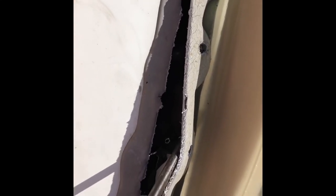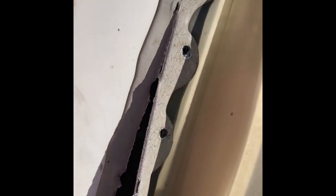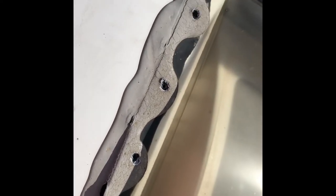The next part is just starting to peel this thing off. You'll see the factory put a seal down before they put lap sealant on it, which is the hardest part to fight through. Just a little pressure and a little time — take your time on this part. You don't want to break it because then it becomes a real pain. Just go slow and start prying along the edge until you can get enough to lift the whole thing off. There it is — right off. You can see how much came up, so I'll spend the next part scraping and cleaning, being careful not to cut the TPO roof.